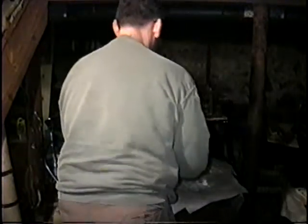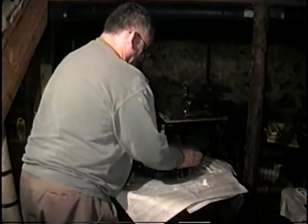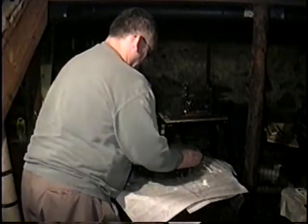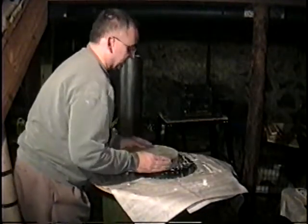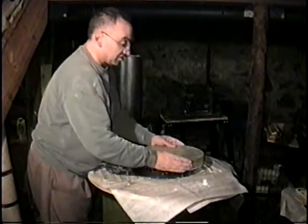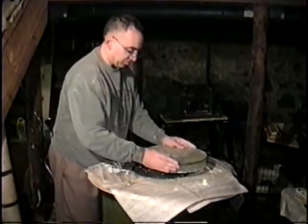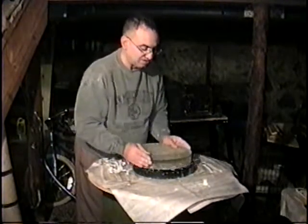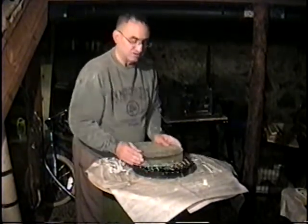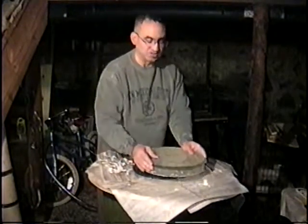Now, I also look at the temperature that I'm at. I'm using Gugolz 70-degree pitch. And the rule of thumb is that the number of the Gugolz pitch should approximate the temperature at which you're going to be polishing to get the proper hardness of the pitch. Right now, coincidentally, it's in the low 70-degree range down here in my basement. That's going to change dramatically over the next couple of months. So I want to get this polished out fairly quickly, so I should really devote a lot of time right now, because this basement does get into the high 30s, and there just is no pitch that is soft enough to be the appropriate consistency to polish at 39 degrees Fahrenheit.